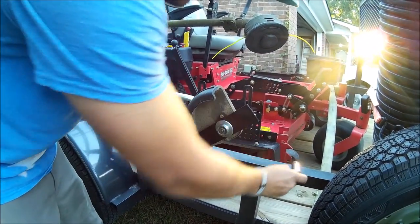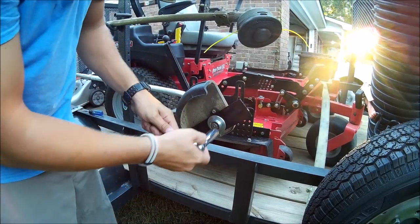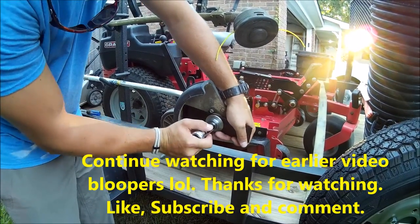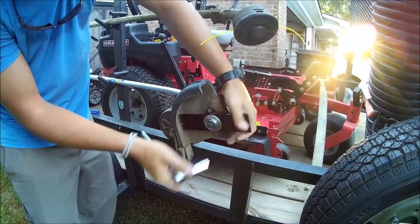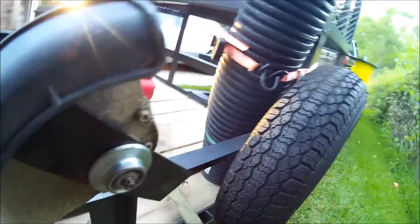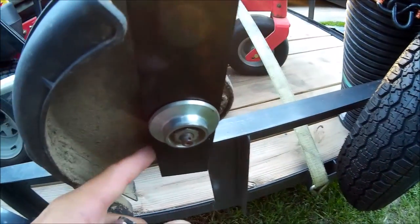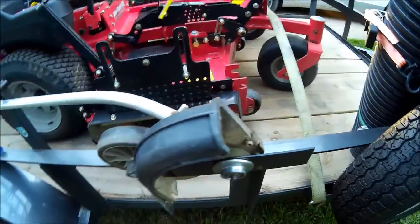Get it going with your hand, put your socket on there. You're going to turn it left as well, which is weird because normally right tightens and left loosens, but on these edger blades they're totally different. I just use my hand — a lot of people get them way tighter than that. You snug it up like that and you're ready to go. There's also a hole right here for a cotter pin, which I do not use — it kind of gets in the way. I know it's for safety, but it's spinning this way so it's just going to do nothing but tighten itself.